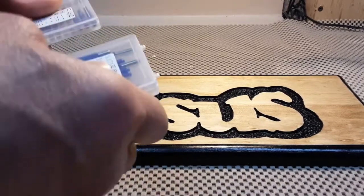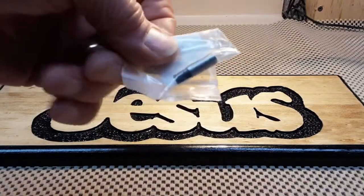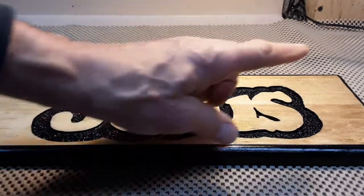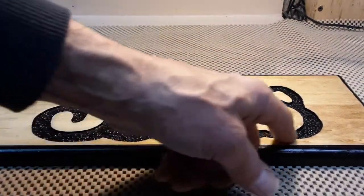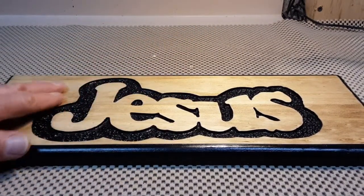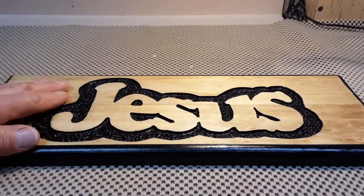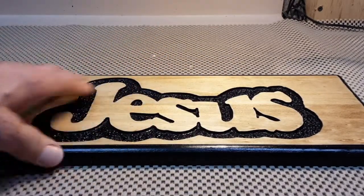Just so you know, these CNC bits, I'll leave in the description, along with the milling bits, these 3.175 bits, and also this collet reducer that you're going to need for your quarter inch router. I know in the beginning I told you I had started out pretty rough, and I think it was because I went too deep with that CNC bit when I went around and traced the sign and did the contour. I went down more than an eighth of an inch, I know that. What I should have done is a sample cut in a piece of wood so I could get my depth. It's a good idea to do a practice run on a piece of scrap wood. This way, when you get into your milling bit to do the clean out, you can set it at the same depth, and then you won't run into the problem that I did.